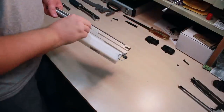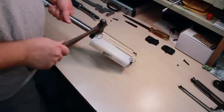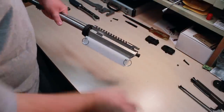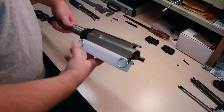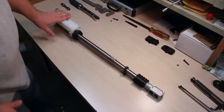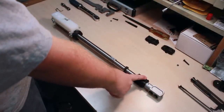I've got that Delrin block lined up with a little massaging and this should just go right through. You want to be careful with the hammer. I know these holes are lined up - I looked. The tolerances are very, very tight on this upper and lower receiver set. I've got the Delrin block installed. I'm going to go ahead and take off the muzzle brake.